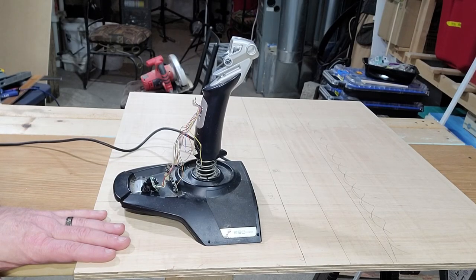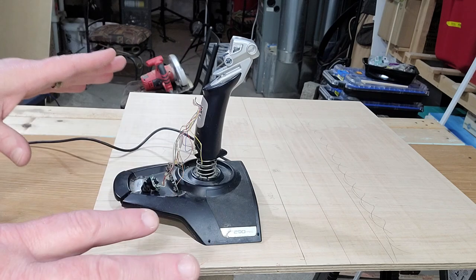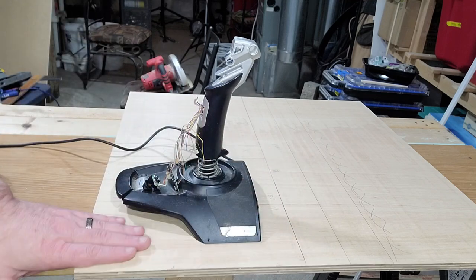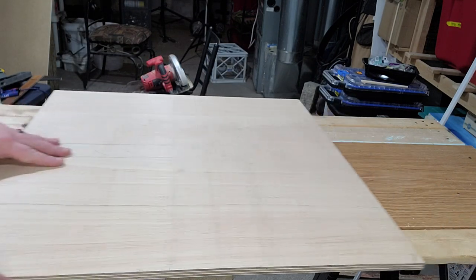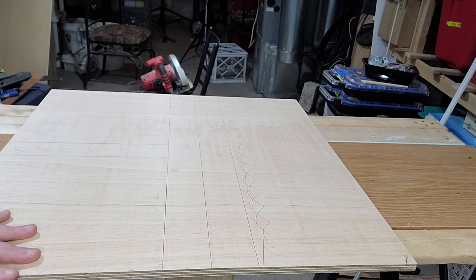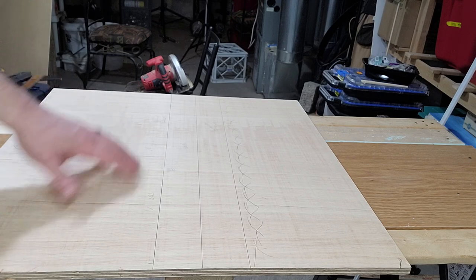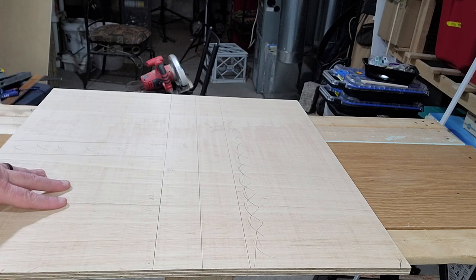The first thing you want to do is mark up your wood for cutting. I'm going to include a link below to some brief plans for all the pieces you need to cut out, but it's not going to have dimensions because that varies depending on your needs and the size of your controller. You want to leave about half an inch to an inch all the way around the perimeter of the controller for your top piece — I went with 11 inches. You can see we've got a top piece, a bottom piece, some feet, and the cross member. One of the tricks with woodworking is when you mark off your areas, put X's on the scrap areas so you know which pieces are which.